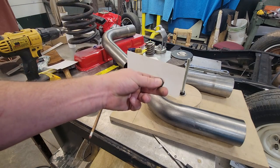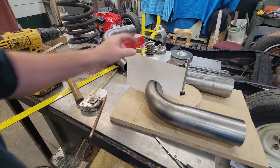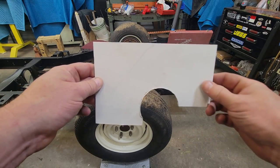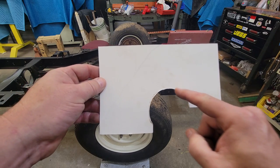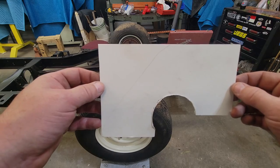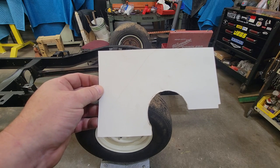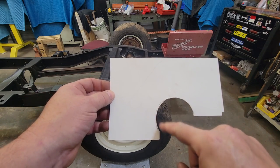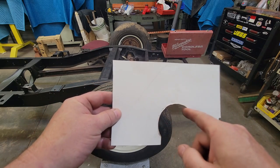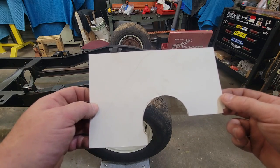After we hollow the threads out of these nuts, I'm going to set them up and get this piece cut out, tack them, and see if it freely rotates. I don't have any three-eighths ID tubing, that's the only reason I'm doing it this way — if you had some three-eighths ID tubing that would just slip over it you'd be golden. We've got a couple of half nuts and I'm going to drill the centers out. Here's our finished little sweeper — it goes back here at the stud.